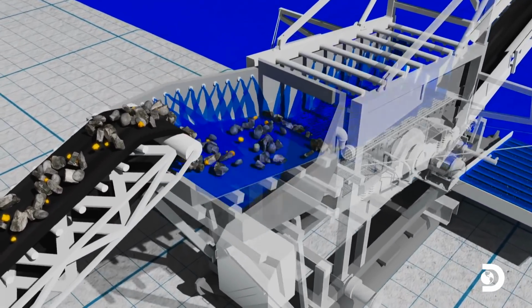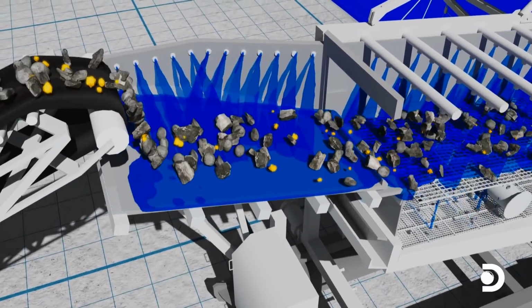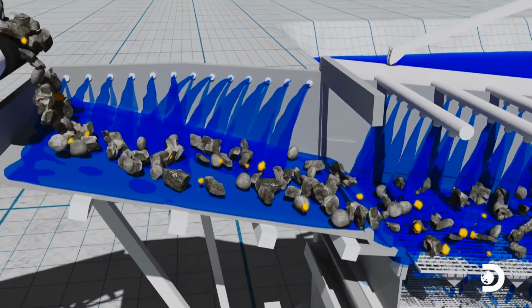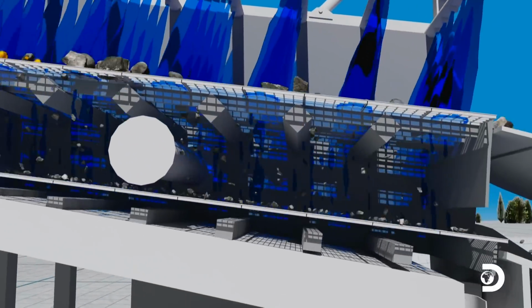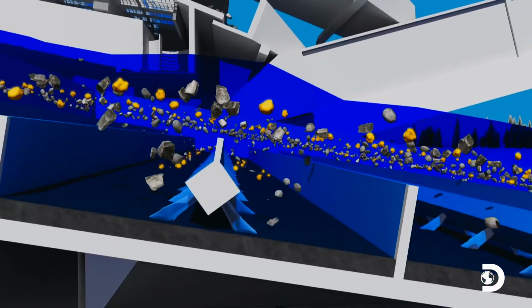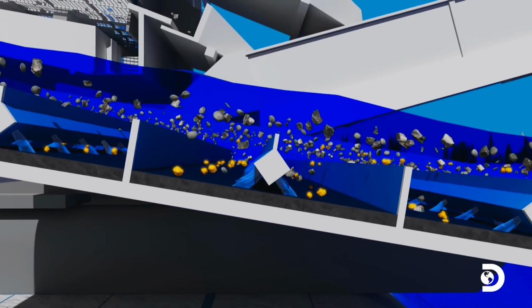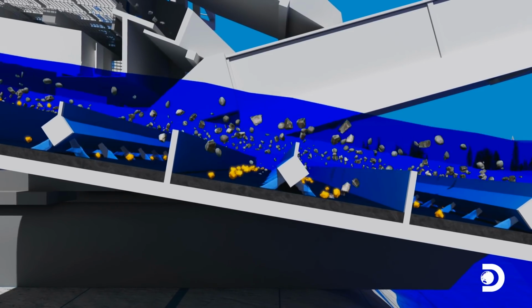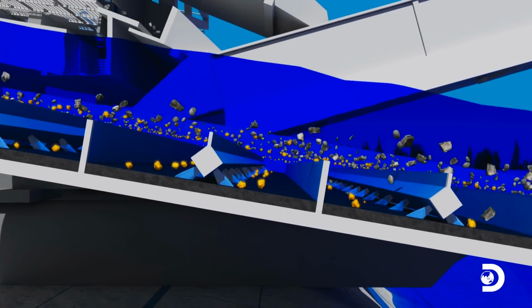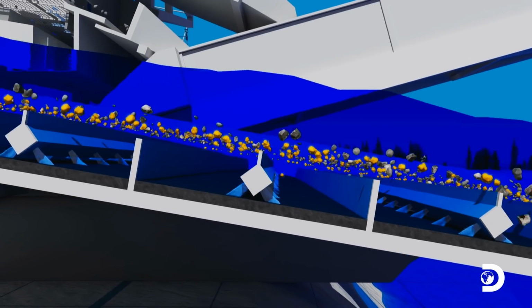In wash plant Slucifer, water jets wash gold-rich material from pay dirt. Vibrating screens separate out the rocks from fine material. In the sluice runs, riffles force the heavier gold to sink into thick mats. Doumitt believes excess water is forcing gold out the back of the plant.